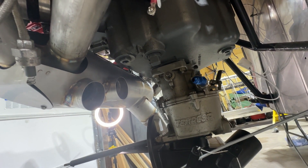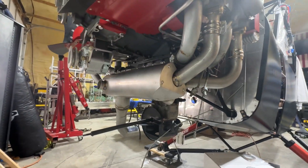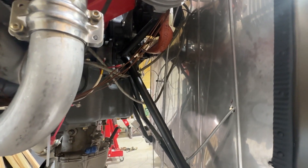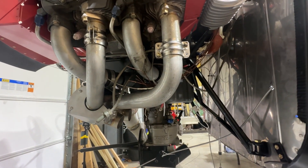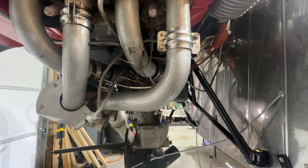This exhaust makes good heat despite being a smaller form factor. The original Piper exhaust ran right through the back, rubbed against the firewall, and was impossible to get to — you had to swing things out to access it, and couldn't do anything behind the engine with it on. The leading edge exhaust and this one both forward-mount. I also have the Atli Dodge hot rod exhaust on a couple of cubs — it's loud and does open things up — but this Sutton exhaust is going to give you as much power as the Atli hot rod, if not a little more, based on how it flows. The access, maintenance, build quality, and price all together make it a no-brainer for me.